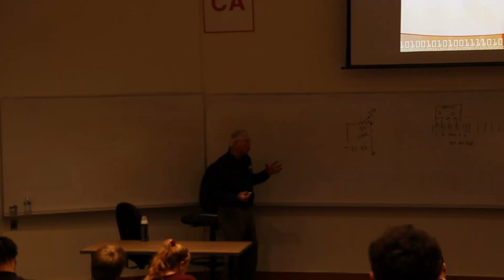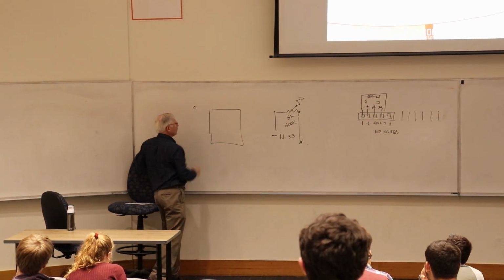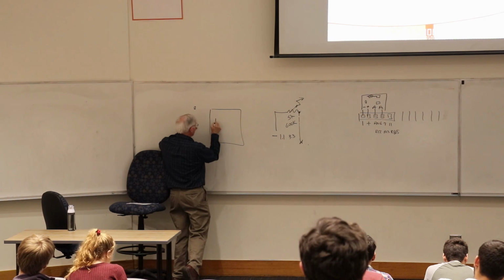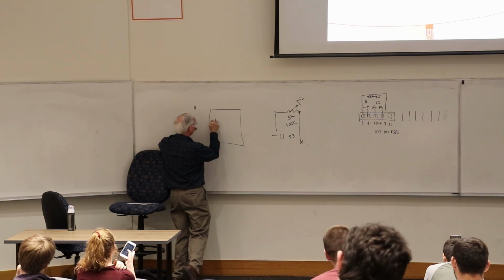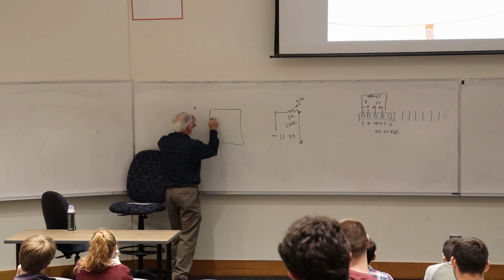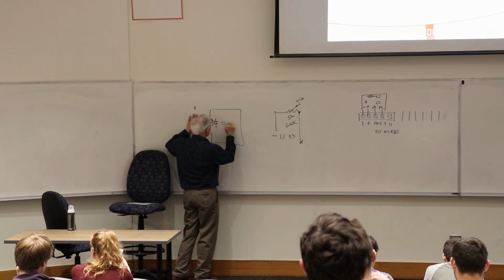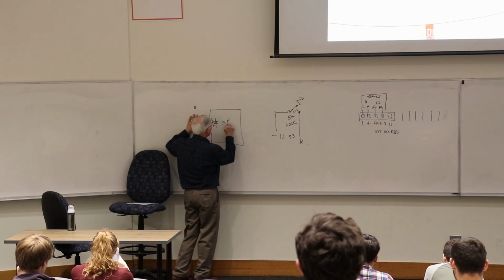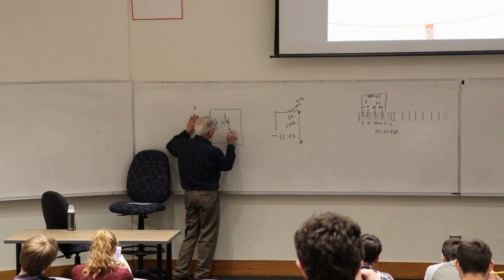So here's how an opto-isolator works. It's really very simple. We have a little thing. They're usually quite small. So physical size might be like this, about that big or maybe slightly bigger. And on one side, we often just have an LED. That's the arrow, supposedly. All right, whatever. And then it shines light across, and over here, we often have a phototransistor, a BJT, driven by some circuit, and so it's biased in some way, and I forget, we've got something. And then we have this over here, and often this is driving probably a FET.